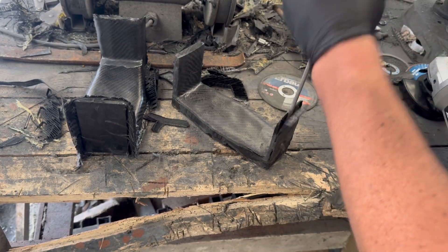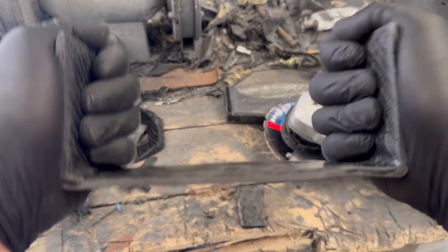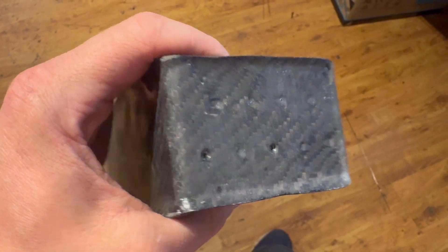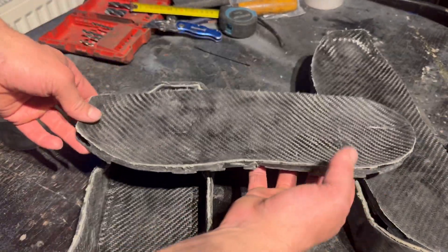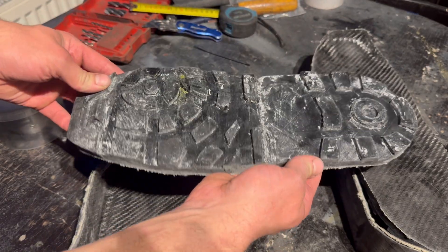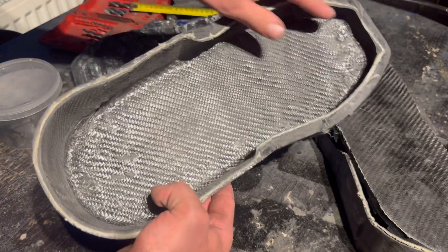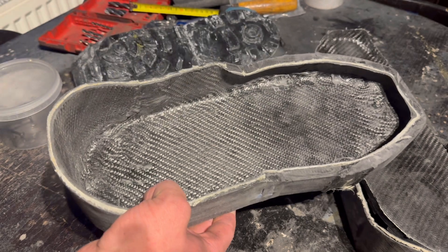It's a sacrificial mold, but it worked very well for this prototype. It came out pretty neat — 12 layers hand laminated — and was also pretty strong when I tried to bend it, so I'd say a decent success. Even straight out of the molds with remnants of wax left, you can still see the indentations for drilling the holes. The soles also came out pretty well, although there were some imperfections around the front that I had to go over after, but it's set well with no air bubbles. The clog parts of the boots themselves came out all right as well, trimmed up pretty well.